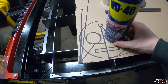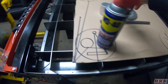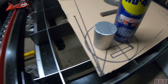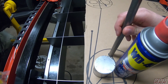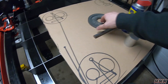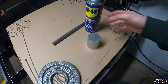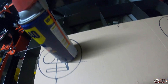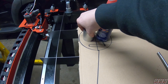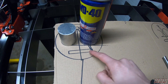WD-40 — Miracle Worker. I think that would have been perfect if I had a fine point, not a chisel tip. Here's our block of aluminum — that looks nice. Here is our rod — looks good. Even on our 100-inch travel, it looks accurate. The steppers, once they start moving faster, can potentially start skipping steps. You will see here that the increased speed made the rectangle corners a little more curved.